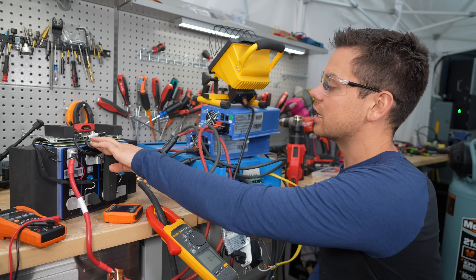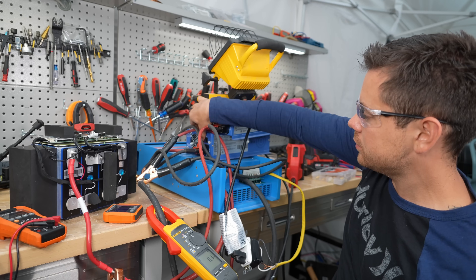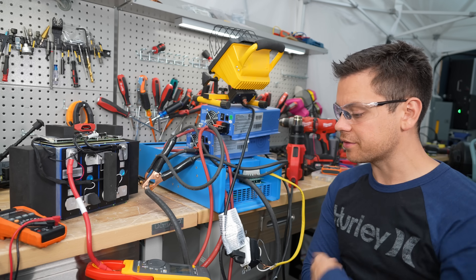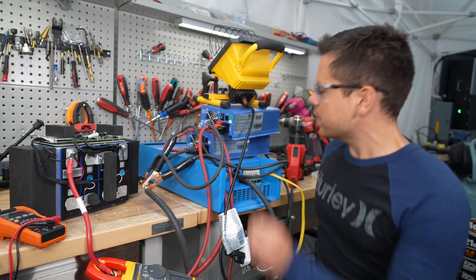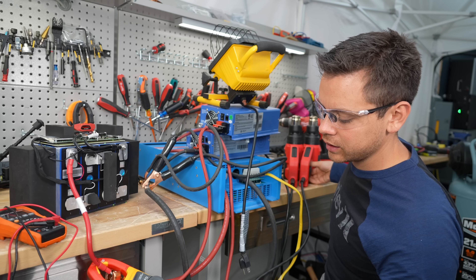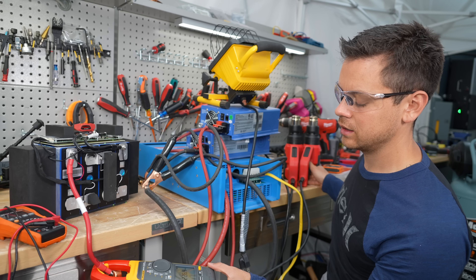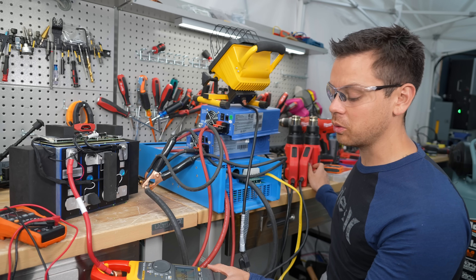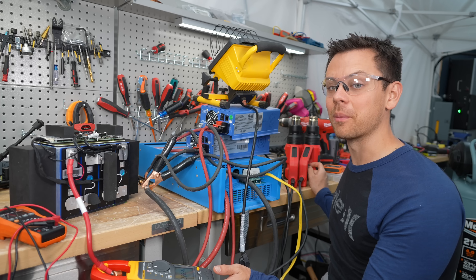They also have proper size conductors, but I do want to be able to trip the overcurrent protection. Let's charge it up again. Coming back after 20 minutes for the final test — at 220, 222, and then 226 amps for over a minute and it still hasn't tripped. So this does not have overcurrent protection.